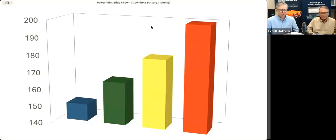MWD batteries are basically high temperature batteries. There are 4 different basic temperature ratings available: 150, 165C, 180, and 200. The 165 is by far the most popular. Most of the batteries out there utilize 165C rated cells, so that's what you mostly see out there. And there are different versions of this cell. We have high rates and moderate rates. When do you use one over the other?